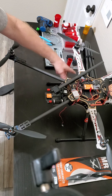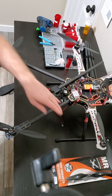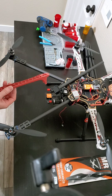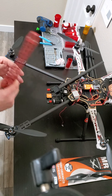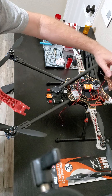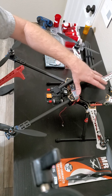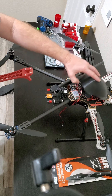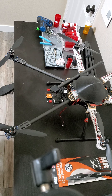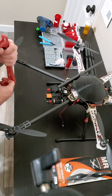By replacing the arms with carbon fiber, I'm reducing the weight of the frame significantly. I also removed the original plastic landing gear with foam and replaced it with carbon fiber fixed landing gear. I printed a landing gear mount on my 3D printer to bring them out wide. This right here — the canopy — was also 3D printed, and I'm going to vacuum mold it to reduce its weight by almost 70%, since 3D-printed parts tend to be heavy.